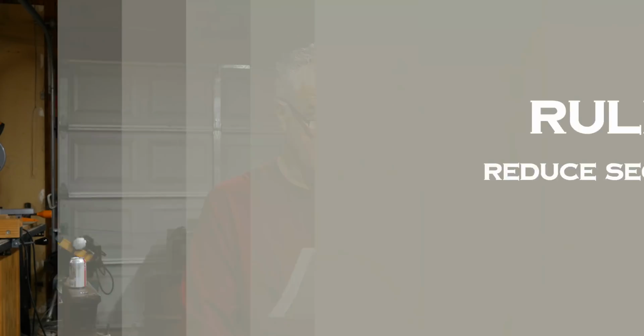For intermediate sections, either one, reduce the problem by avoiding convection loops in the geometry of the casting and rigging. Rigging, is that what you call it when you make all the gates and stuff? Two, avoid feeding uphill. Well, there it is again. Or three, eliminate convection by rollover after filling. I don't know that. I'm telling you right now, I don't understand that.